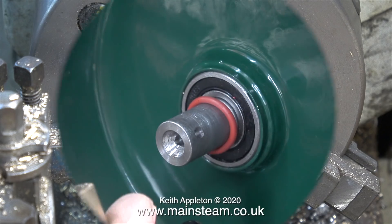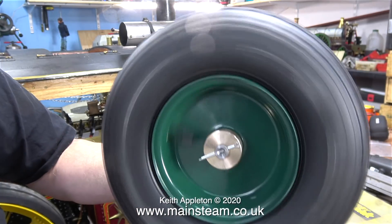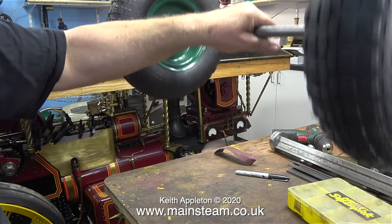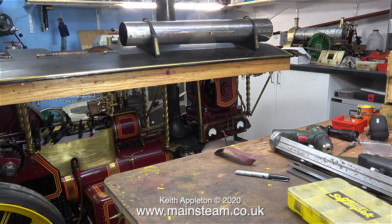Now I'm going to fit the first bush to the wheel. First of all I fit a silicone o-ring to the axle, followed by the bush and a split pin. Not only does the o-ring stop the bush from rattling, it spaces it away from the bearing a little bit. Both of the wheels spin very freely and the whole assembly isn't very heavy, although it's very strong. That's it for this episode — stay safe and well, thanks for watching and I hope you found it useful.